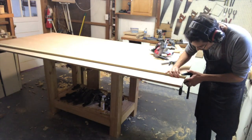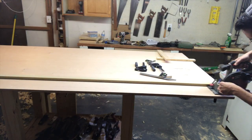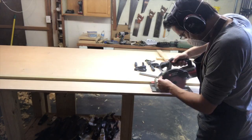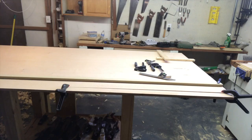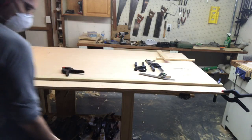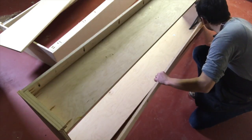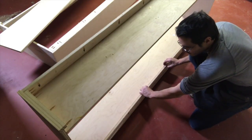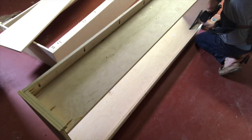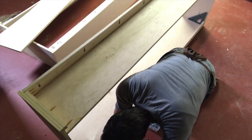Now I'm moving on to the final sheet of three-quarter inch plywood, which is going to comprise the main desk area. I begin by clamping a long, straight piece of wood to the plywood to serve as a guide. This guide will help me cut thin strips of wood that'll serve as top guides and support structures for the shelf. It's really important to have this there, because you're going to attach the backing of the shelving unit to it and screw the shelving units to the stud through this strip, since it's three-quarter inch thick — otherwise you're trying to secure it through very thin quarter-inch material. It's just a matter of gluing it and using pocket screws to secure it, and I attach it to the top back of the shelf.